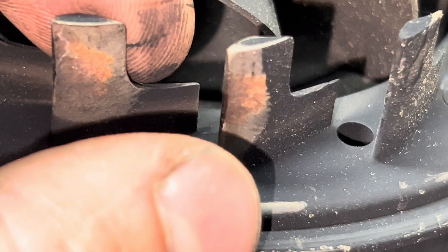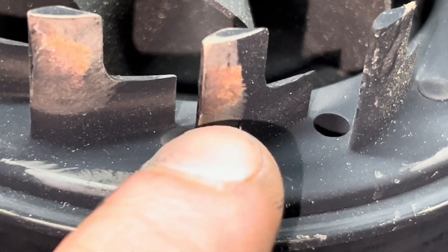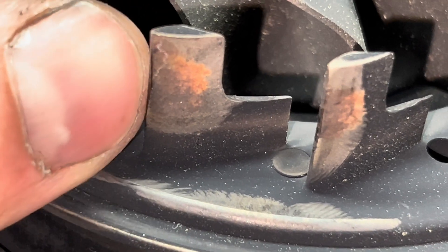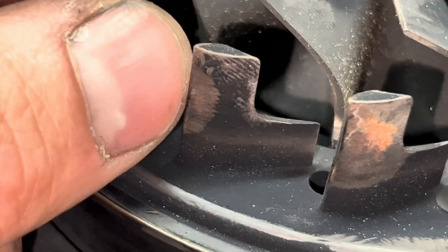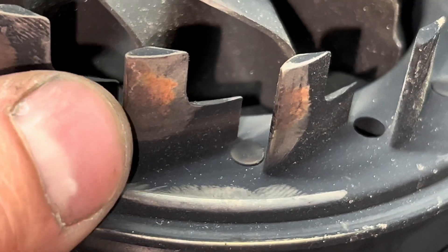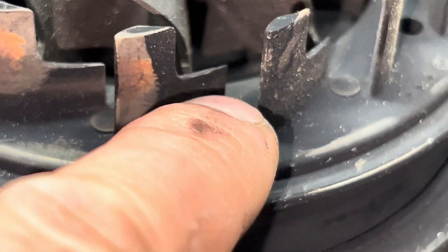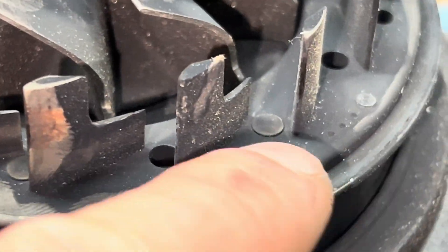You just really have to feel them. See how it's got that flat edge on the back right there? It starts to mushroom over and that needs to be filed right there so it will go in properly. Same with that one right there — it's got that little shiny edge. That is probably the most common thing that needs to be done on these: just filing the backs, and sometimes on the inside and on the outside right there. Just make sure they're straight and square, no cracks at the bottom or anywhere else, and that you've got your pins in there.